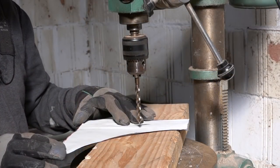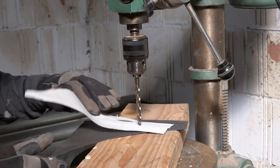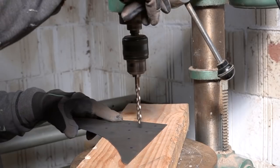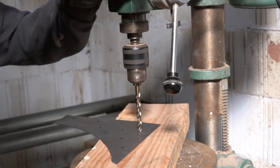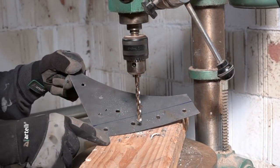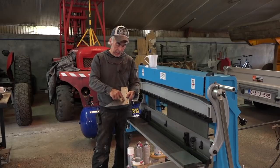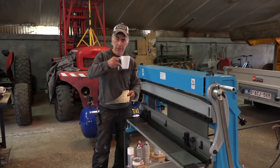I made a template to further strengthen the support at the inner side of the cabin. Now I'm going to drill some holes in it so I can spot weld it — I already marked them. It almost looks like Swiss cheese, but I'm going to fill up all these holes with spot welds. The last thing is we need to bend it along this line so it fits nicely inside the support. But first, a bit of tea.